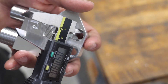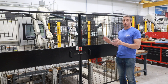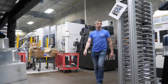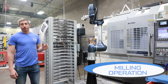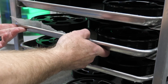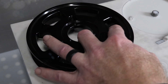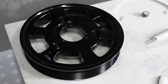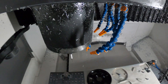These parts may be brought into a polishing area, but first let's go to one of our milling operations. This mill is what we use for our black diamond finish. Any parts coming back with black anodizing that are going to be turned into black diamond all come here. Each part has its own specific fixture and is programmed to run on this machine. When each part is loaded onto its fixture, it's located with screws, pins, dowels, or any combination of those three. Once the fixture is loaded into the machine, a probe will then check the part for a few locations to ensure it's in the correct position for accuracy.